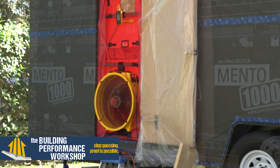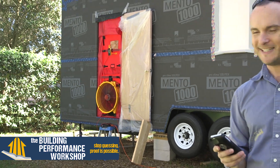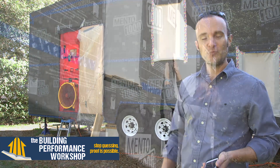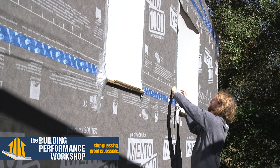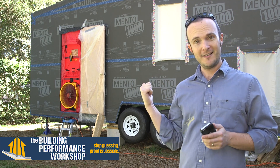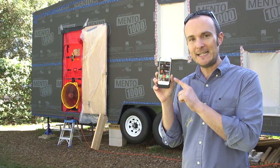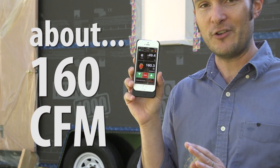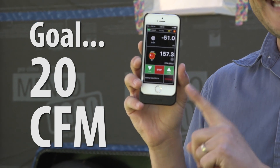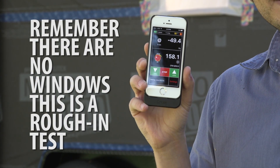You can hear the fan drive up and now it's going to drive back down. What we're doing right now is a really bizarre test — this isn't actually real world. What we're testing is a very worst-case scenario. We've got plastic covering all the windows, and we've duct-taped the plastic to the weather barrier. That's not ideal because duct tape does not do a good job of air sealing almost anything, but I don't want to damage my weather barrier, so we're going to rip that back off right away. What I have right now is a reading of about 160 CFM. My final goal for this house is going to be about 20 CFM if I can get to passive house levels.